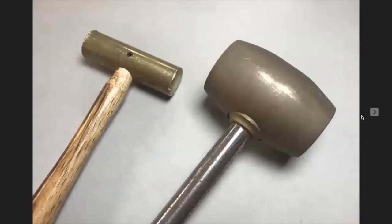Here are two more brass hammers. The one on the left is the one Pauline Warg sold at Idlewild — it's a lighter weight hammer, good for softer stamping, but for most stamping I'd use the heavier ones. This is Tough Break — a material used industrially to protect sheet metal in a bending brake. It comes in several thicknesses and widths. It's optional for stamping but can add interest to pieces. I buy it in 100-foot rolls, so you can talk to me if you want some.